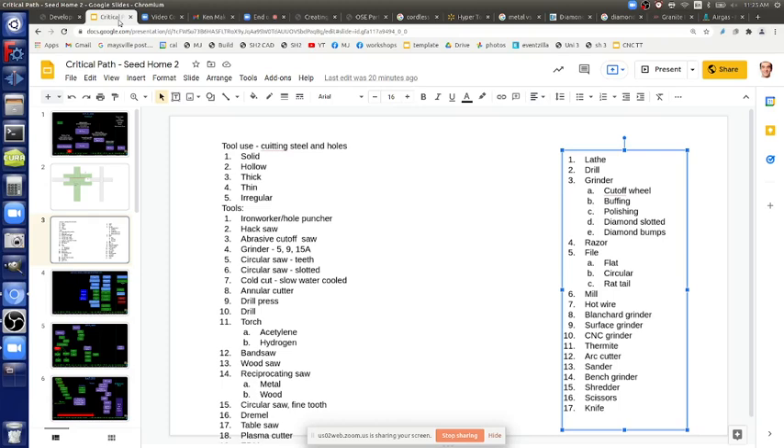The abrasive works by spinning really fast — that's how all the sparks fly. Small grinder wheels are like 10,000 RPM. Large grinders maybe 5,000 RPM. Typically faster than a regular abrasive cutoff, which is like 3,600 RPM. How do you get 3,600? It's 60 hertz — 60 per second means 3,600 per minute. That's what you cut wood with.